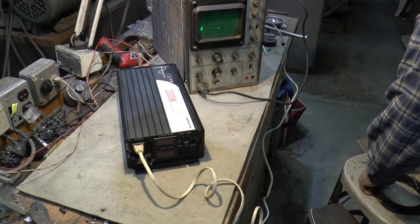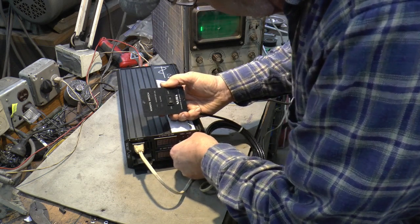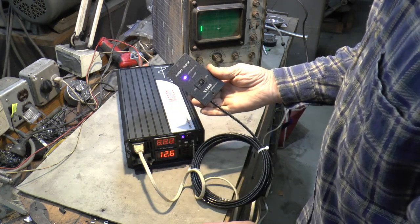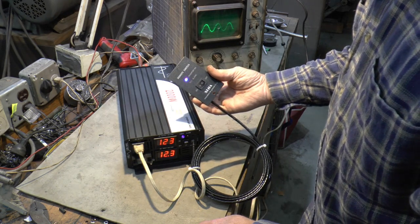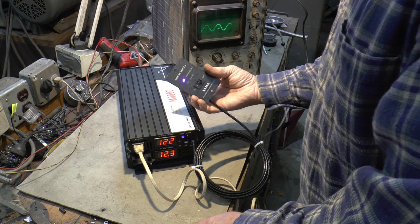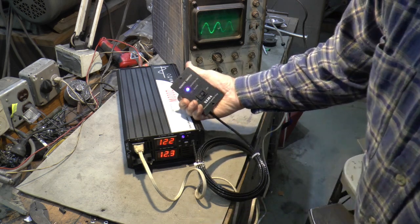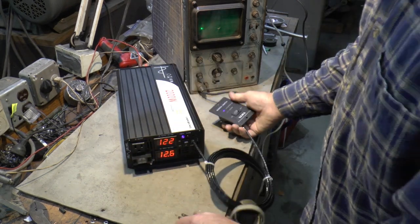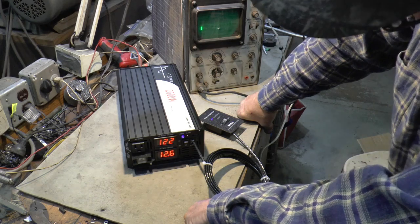Turn it off. I'm gonna try this remote. The alarm is on until the voltage gets up to normal. So I got a 15-watt bulb hooked up and the inverter running — my power supply says 1.6 amps at 12.6 volts. If I unplug this — good tight outlet — it's saying about 0.6 amps for idle. I guess that isn't too shabby.